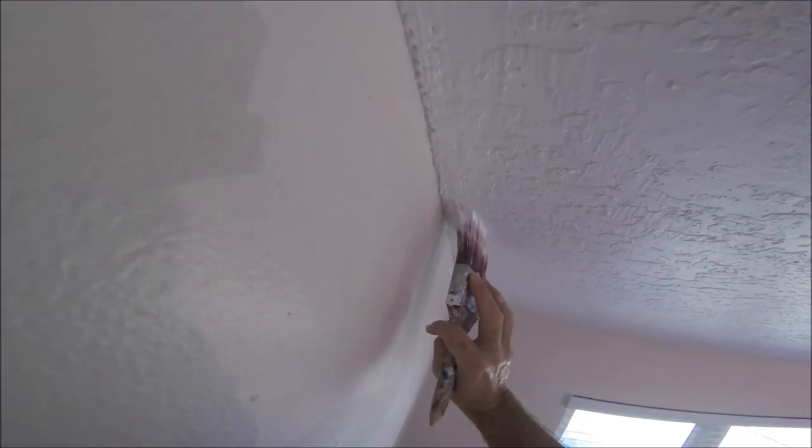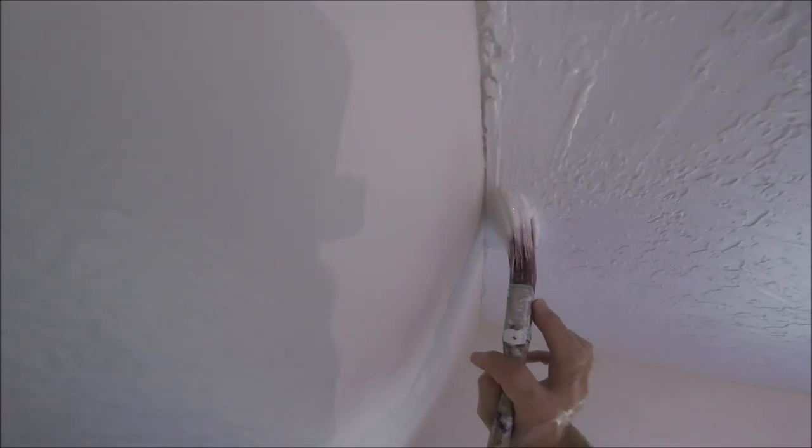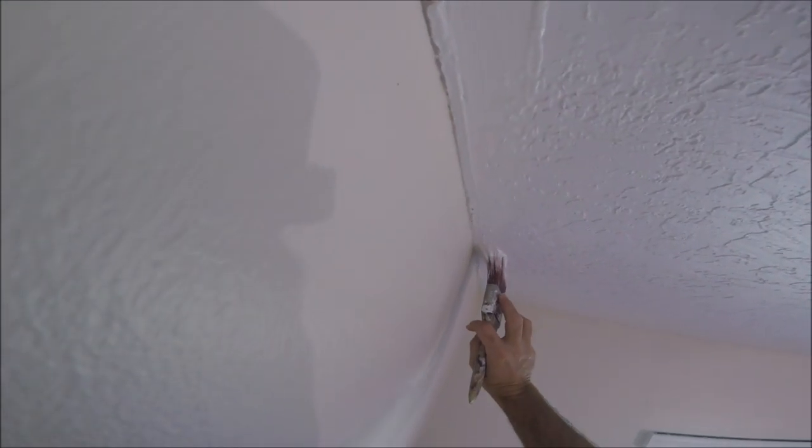Now if we were painting the walls I'd have already run the caulk bead. Just a real small hole on the caulk tube. You want to get it as close as possible — you can stay out about a sixteenth of an inch, because the caulk is going to hide that. Use a nice bright white caulk to go along with the ceiling. Let me know in the comments if you're a DIYer, a contractor, painter, or handyman — just kind of curious.